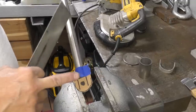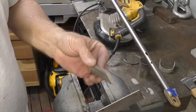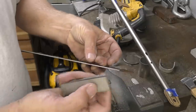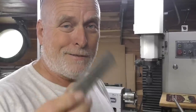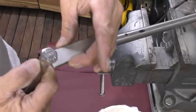Now the other piece is just a tab for a bolt to go through. And I could use something thin or something a little thicker. And I like going with the thicker. Thin, I can't ever make it rounded over, so that could go into your cranium pretty good. Whereas something thicker, I can round it over a bit. And still, if you don't pay attention, it's blunt force trauma, but maybe we don't have to pull it back out of your skull. So I'll weld this onto the pipe, leaving a little bit to stick out, and then this will latch over it.